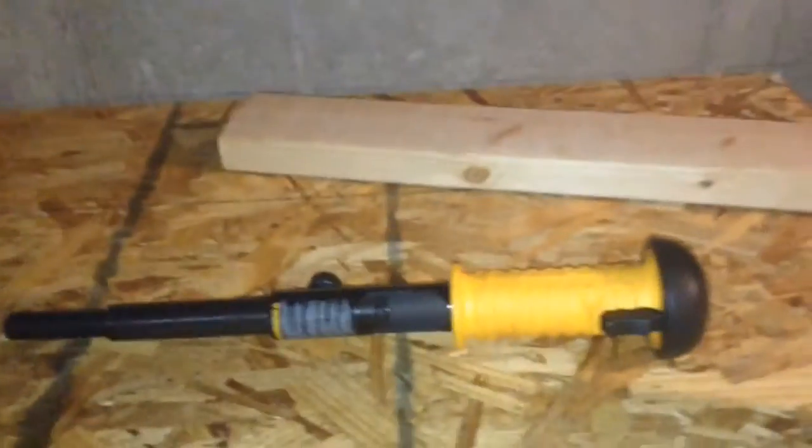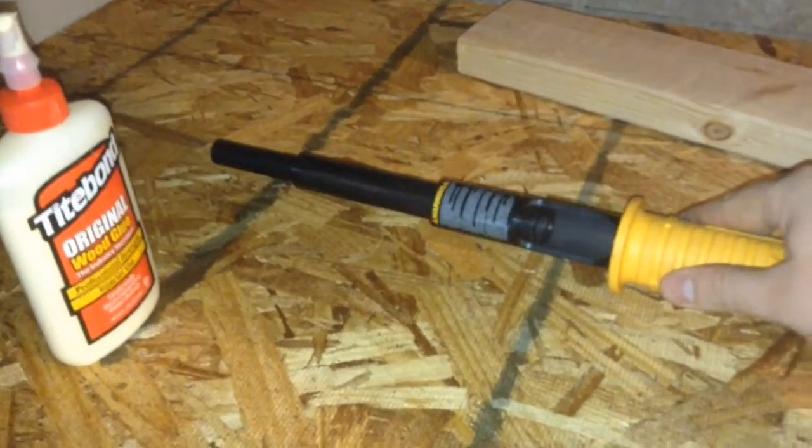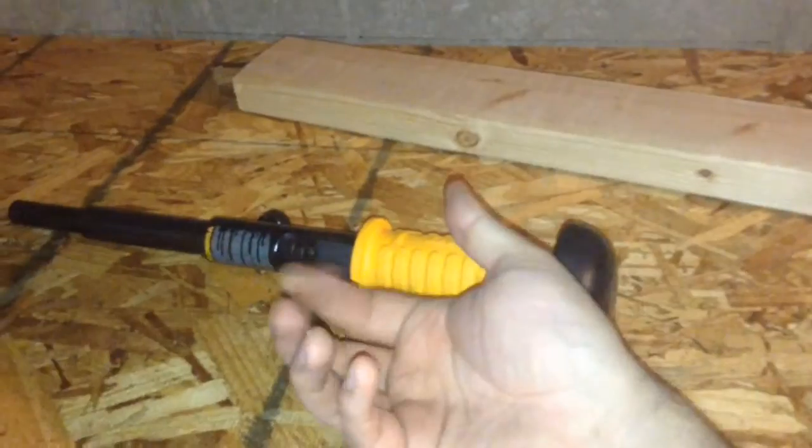Just working also on the stage one construction of the food storage. I basically have gone ahead and anchored multiple anchor points to the cement wall. You can do that with a powder hammer. Basically it takes a powder charge. These are also called finishing hammers, or they have triggers or points where you can hit it on the end with a nail. Sometimes they have gun triggers. Powder charge, nail in the tip, load it, and then you put it right in the wall, squeeze the trigger, and they go in.